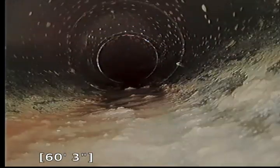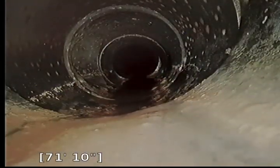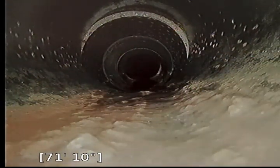All still newer 4-inch ABS pipe here — no issues still. Another vertical T-junction there, possibly picking up the upstairs bathrooms. So we either have a repair or a little offset when it was put in with, possibly instead of glue, a FernCo joint. You can see a slight misalignment of the pipe. You can see the wall thickness of the pipe on top there — it kind of looks whitish in color — that's the outside edge. And as we go into here, it just drops the camera down a little bit.